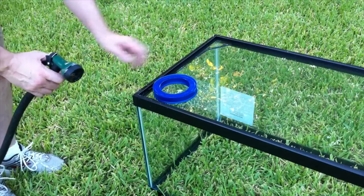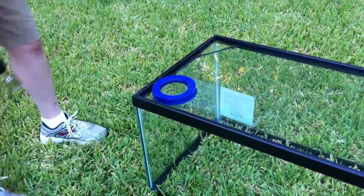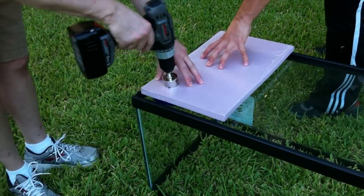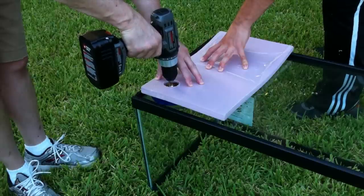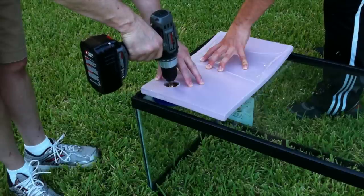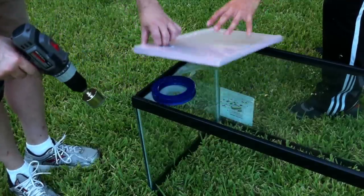I used a helper — my son — to hold the pink foam in place so it would locate and keep that bit exactly where I needed it. Having a helper hold that pink foam, or you can use something else like a wooden board or a piece of sheetrock, you just need something to keep the drill bit from wandering when it first starts carving into the glass, otherwise it'll dance across the surface. It takes about 45 seconds to a minute to create a nice groove, at which point you can remove the template and continue drilling without the obstacle blocking your visibility.